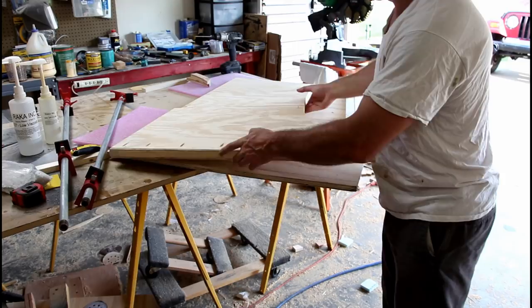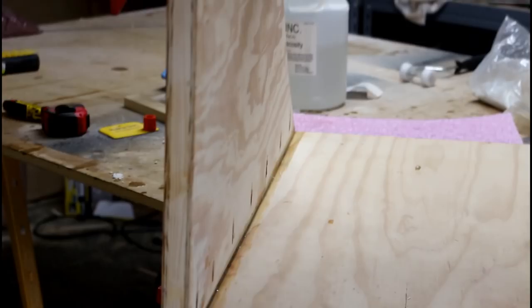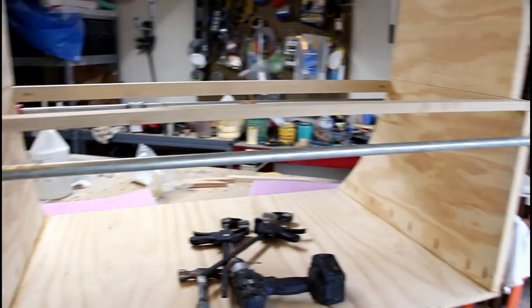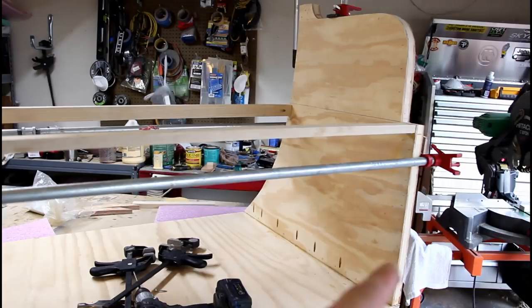I have my tongue box setting up now. The first thing I did was put the epoxy down, then I came around to the side and put a clamp on so it would stay upright. Then I came back, put my pocket holes in, went to the other side and put that one up, then came in and put this piece up here. This is actually where my seal is going to be on the lid. I also put a pole clamp in there and clamped the back piece down. That should make these vertical since that's the length I needed on those cross members.